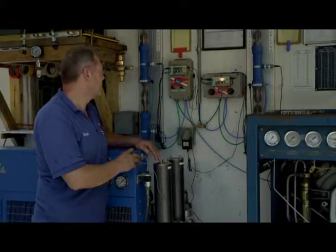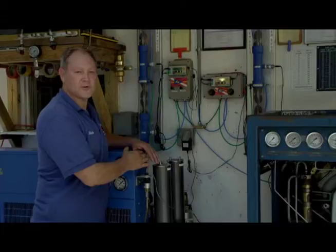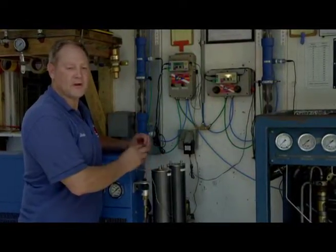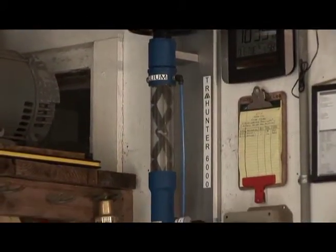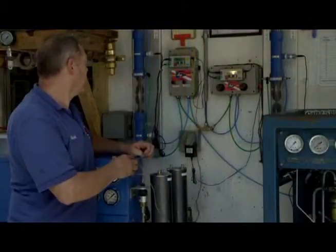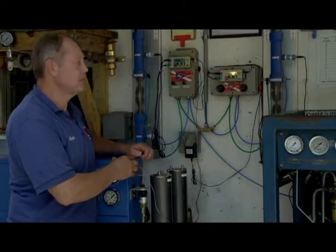Once that calibration is complete on both of the sensors, the number 1 and 2, or upper and lower sensors, then it will give you the next message, which is up turns on the gas. And that will then open up the solenoid valves that are inside the box that will allow the gas to flow from our source into the box and then out of the box into the stick so that we can start making our calibrations. So for any of this to work, though, the compressor actually has to be running.